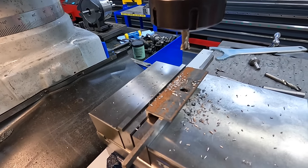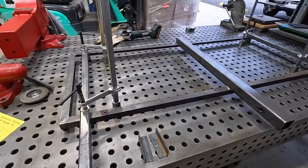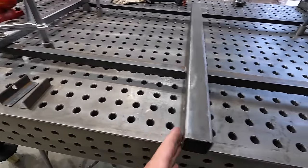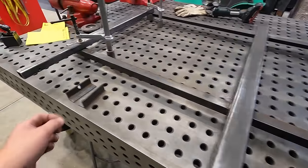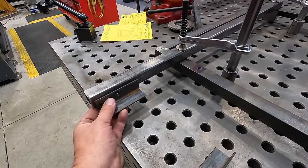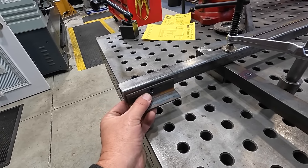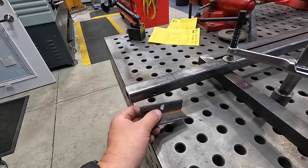There we go — got our slot, that should help that bolt line up really easily. We've got our frame bolted upside down on the table using two-inch riser blocks, clamped down nice and square. Everything is measured exactly the same from tube to tube so all three mounting points are perfectly square to each other. Here's our angle iron pieces that will get bolted on — they get welded onto the hitch tube, then a 5/16ths bolt goes through to provide support on the outward side.